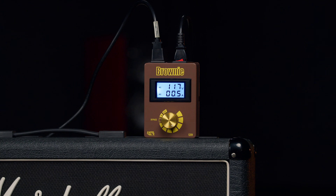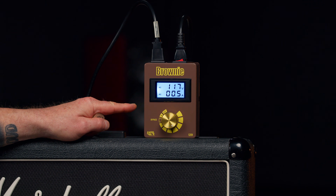So many venues, it's all over the place. Even studios — like I said, this is a professional video studio, but 121 out the wall, and earlier it was 122. So you never know. By the way, this is not an attenuator per se — it's not something that drops the volume of the amp. It does attenuate the voltage if you want, but that's a different story. It's also not a regulator. What it is, it's controlling the voltage coming out of the wall before it hits your amp. And by tweaking it, you can find the sweet spot.